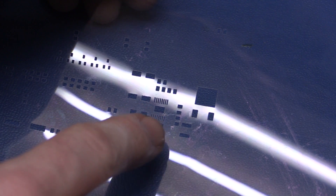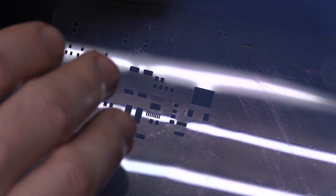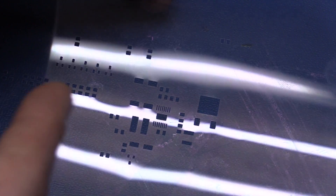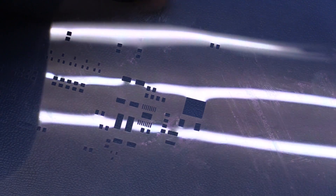When I first got the laser cutter I also tried this with an SOIC, which is a bigger pin pitch, and that didn't even work without the water. So I think it's a good trick and hopefully it will be useful to some of you. If you're thinking about buying a laser cutter, now you know it can also do these stencils — it will only do plastic of course and not stainless steel, which requires a lot more power. Anyway, if you found it useful please hit the thumbs up on YouTube. It helps a lot. Thanks for watching. See ya.